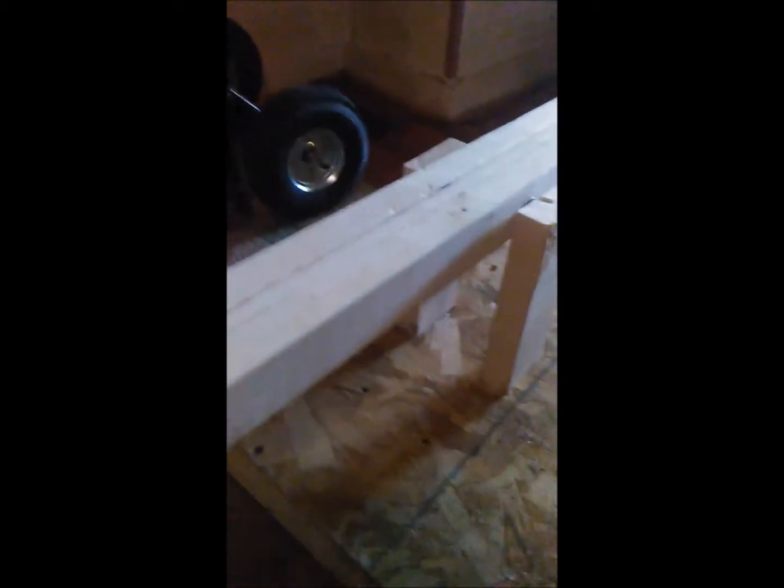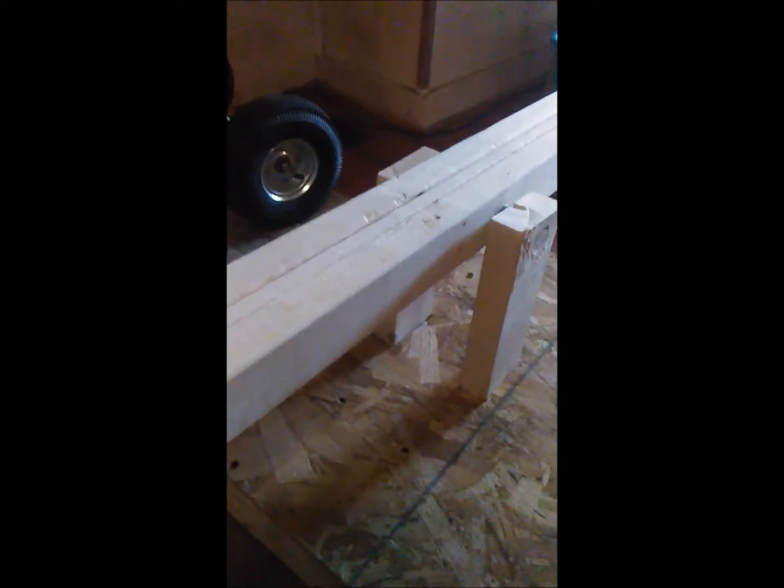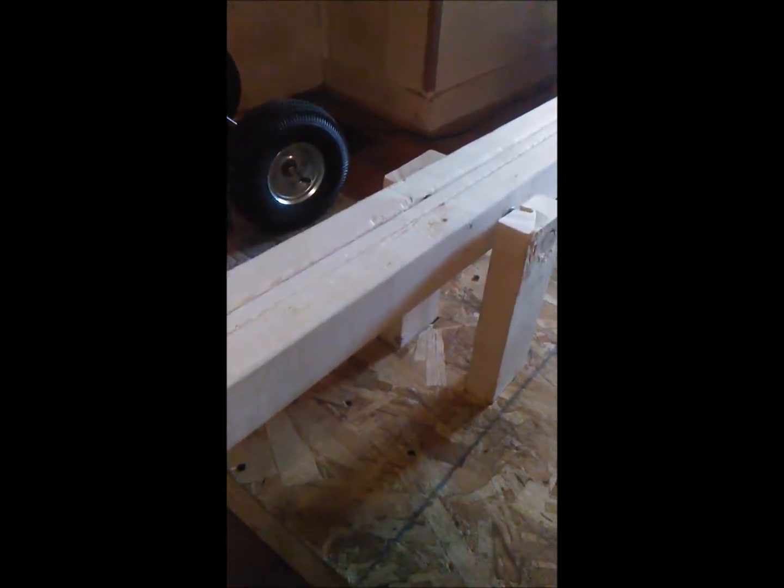See, teeter-totters, move it up and down, hits the floor on that side, hits the floor on that side. So for a 48-inch run, I've got those boards cut. They go all the way through to the floor at 13 3/4 inches. And I took my drill bit and hollowed out these little holes right here. Pull this out of here. See, I took my drill bit and drilled those out, because I don't have all those fancy tools, and it just sits right down in there.